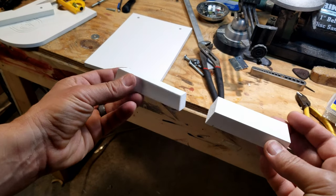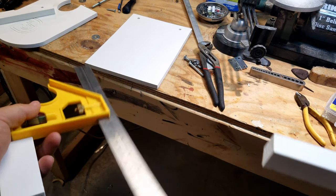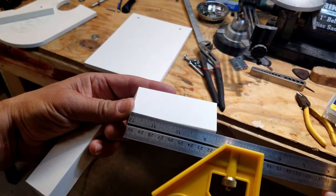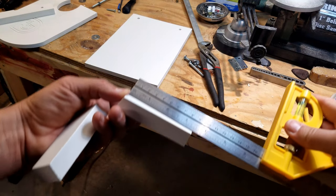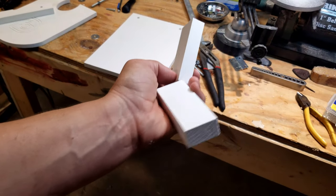I also cut these two pieces off camera. These are cut from the same strip of wood - they are three and three-eighths inches long and cut at an angle. You don't have to cut them at exactly three and three-eighths. If you want to cut them at an angle, you can cut them at the bottom at three and five-eighths - it's a 15-degree angle. So you get two of these.